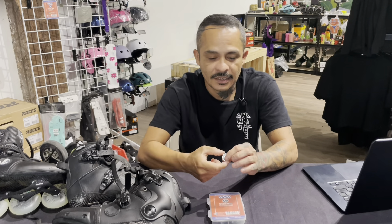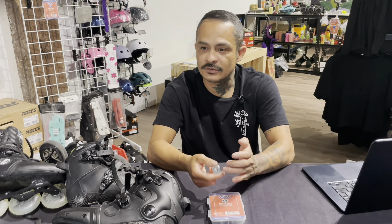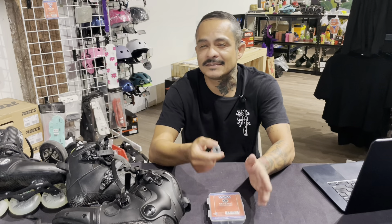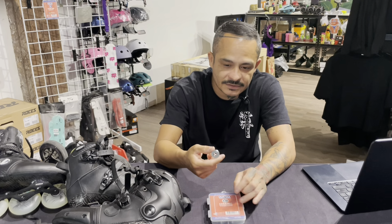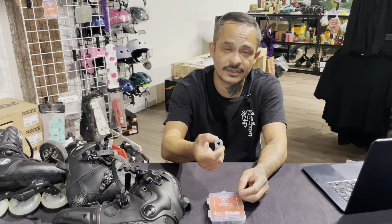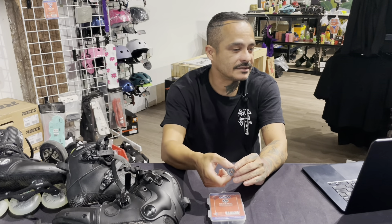Typically, ceramic ball bearings wear a line into the race rather than wearing themselves down, which accounts for any inconsistencies or movement of the ball bearings as they age. Additionally, silicon nitride is a much more uniform molecule, so the surface of the ball bearing is much smoother, which reduces friction significantly. Reduced friction means less energy lost to heat, making them overall much more efficient.